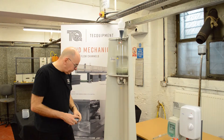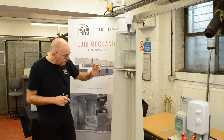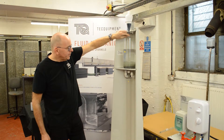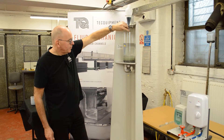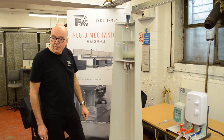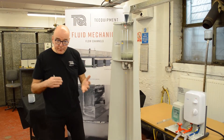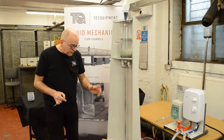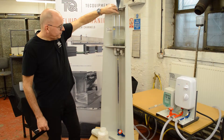When you've done all that, you are ready to create a laminar flow. With a combination of the head and the valve, open that valve very slowly until you start to see a little trail of ink — which is what you see there. That is an absolutely perfect example of laminar flow. When you've got that condition, students will take a measuring jug with a known volume — say a 200 milliliter jug — and with a stopwatch time, for example, 30 seconds to measure how much water is collected.